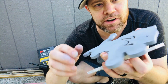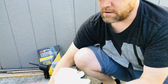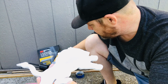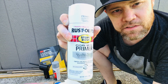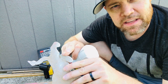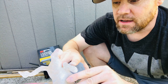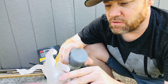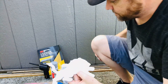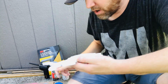Notice how I don't really get too in depth on the middle of it because it's going to be covered anyway. That's the back layer. For the middle layer, this will be painted white — I like to use an aluminum primer or clean metal primer for light colors like white or yellow, because when you're painting on MDF edges, if you use a darker primer like gray, the gray will show through the paint, so I use a lighter colored primer when spraying whites.